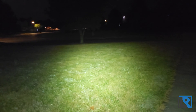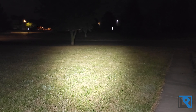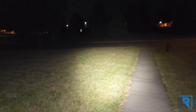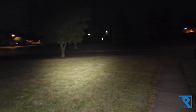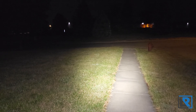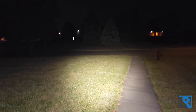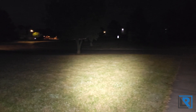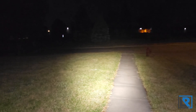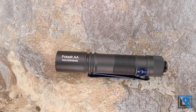For comparison, here is the Olight i5T at 300 lumens — it's just not as bright, and the biggest difference is the cooler white emitter and low CRI. Still good enough to walk around, but it's not where I'd love it to be. The AceBeam Rider RX is next — it's a neutral white, slightly cooler, and also high CRI. The beam throws a little bit better than the PokeLite, but it's also a much more expensive light. And here is the PokeLite again — you can see it throws across the street to the trees with a slightly warmer tint.